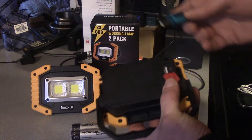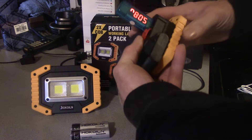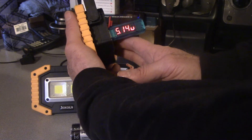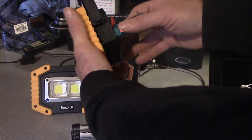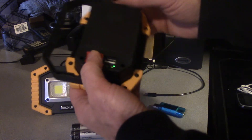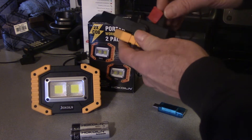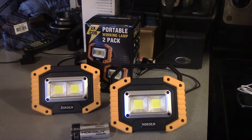I like to get devices like this and before I allow anything to touch my cell phone I go ahead and check the voltage. Okay, we're at no amps and let's see — 5. It's above 5 volts so that tells me we're good on voltage. Then the next thing I do is check not just voltage out but also voltage in, so we want to make sure whatever we're charging these with also has a good voltage, and this is how I do it.